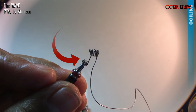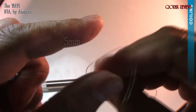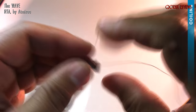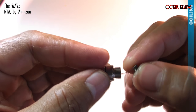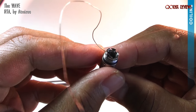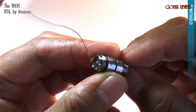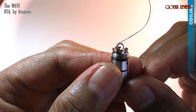Notice the lead length in the positive terminal — it is about 5mm. You will need that much lead wire, and I'll explain why. Then insert the coil through the bottom of the base. There are hexagon cutouts at both ends, so match them. And this is why you will need that lead length — so that the coil juts out a bit from the base.